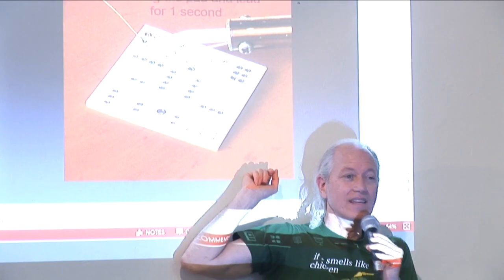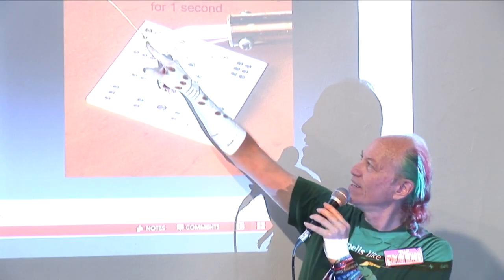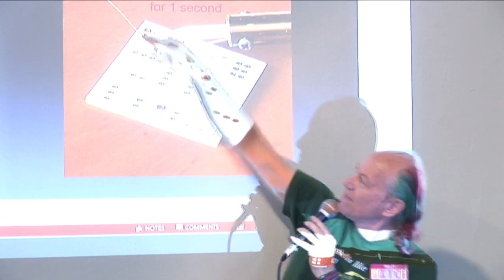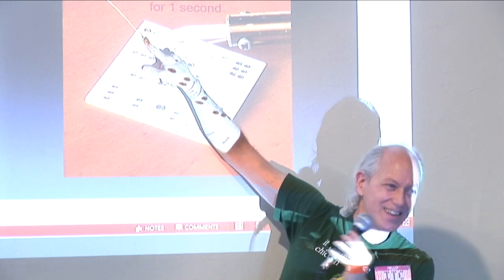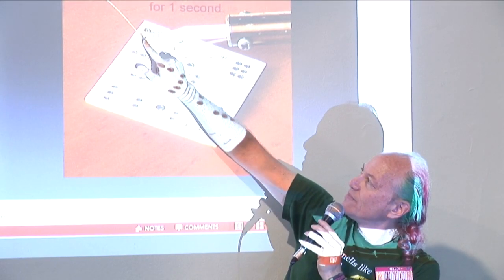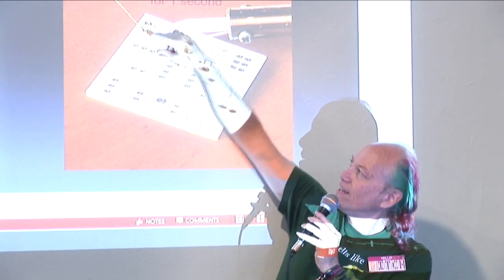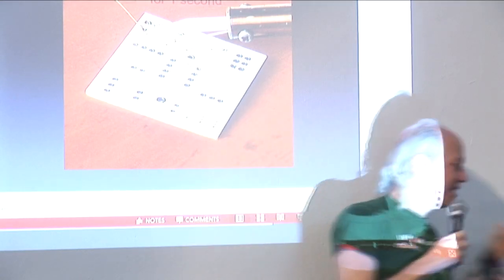So when I feed the solder in, I actually want to scrape along the board horizontally, not coming down like this, but scraping along the board so it hits right where the hot soldering iron tip touches the pad, touches the lead. And not into the lead either, but right here where all three meet. Like this.